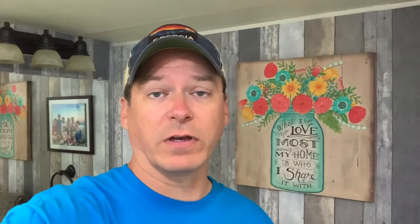To get started, first thing you need to do is get the toilet out because it's a lot easier to work on outside. First, cut off the water to your rig outside and make sure your water pump is turned off. Then bleed off the water from the valve by pressing down on the pedal. Then take the toilet seat off using the two screws behind the seat. Then disconnect the water line in the back and take the two screws off the floor — the toilet just lifts out and you can take it outside to work on.